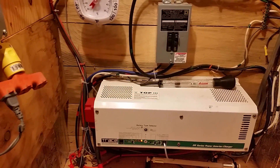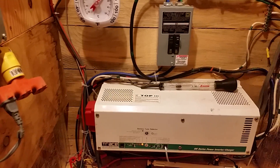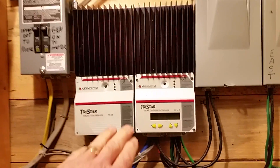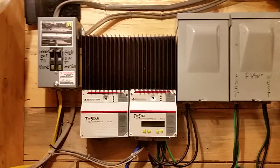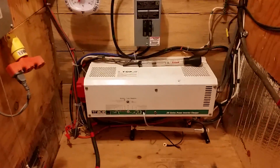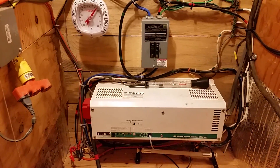When the return amps are turned down it fools the inverter into keeping it in absorb mode a little longer. The reason I'm doing all this is that when this inverter was designed, the thinking on L16 batteries used a different charge algorithm than what we understand today is better for them. So this solar charge controller has different parameters than this inverter does. When this one goes into float, the solar charge controller can put about another 25 amp hours into the battery bank.